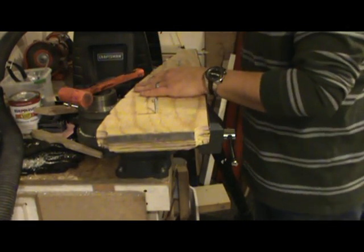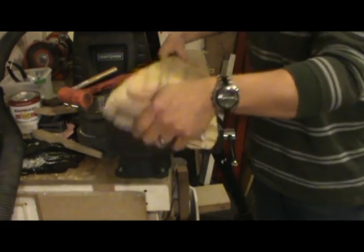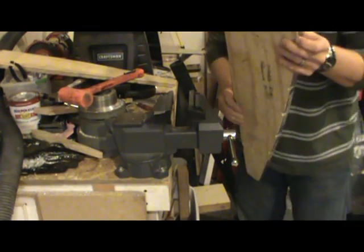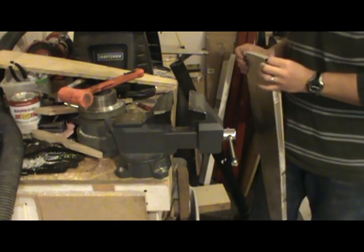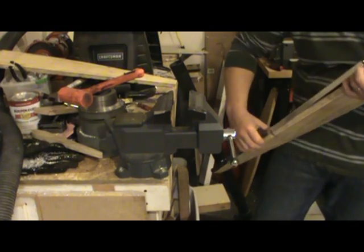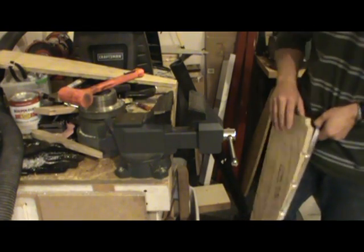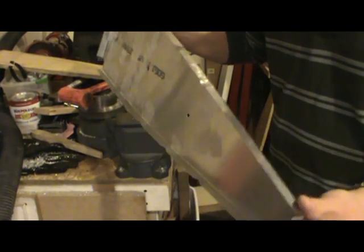When you first pull these away they have a tendency to grip the form block quite tightly. If the bolts are tight I'll pound them out with a hammer and take the top form off. You can see this is actually hanging on quite tightly to the rib form block because those crimps are basically like little fingers holding it on there. But once you get it started you want to be very careful not to put a bend in the form block — you can pretty well just pop it away once you get a few of those crimps started, helping each other along.